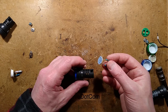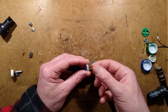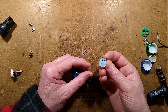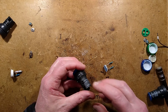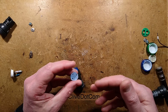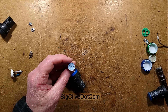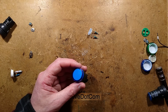Worth mentioning: just by changing these resistors you can effectively customize it to make it whatever voltage you want within reason. You could also do the capacitor trick — one resistor, one capacitor — for a high voltage application. For low voltage, even down to five volts, you could just swap resistors to suit your application and re-solder it back together. Interesting little lights, nicely made, but they've skimped on the circuitry to a ridiculous degree. Using bare chips for everything is quite odd — just the cost of economy, trying to get the product shaved down to the nearest penny.